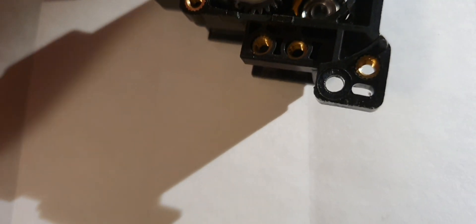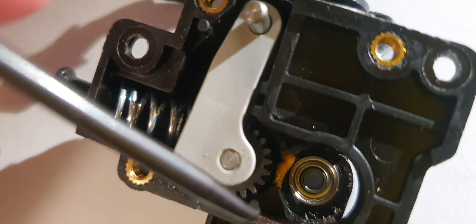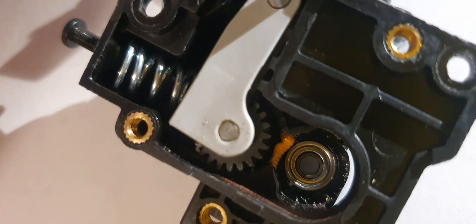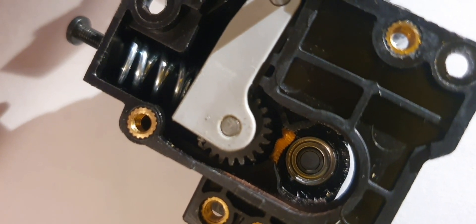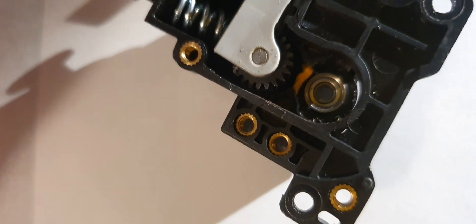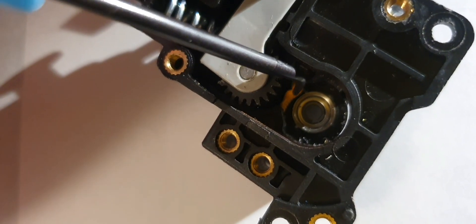Maybe you could change the design here a little bit. Instead of having this piece here come up like an arrowhead, you could maybe have an opening so it comes up like a funnel instead. I think that would be a much better design if possible, to allow filament to pass through if it's just slightly out of alignment, without causing the filament to get squashed, bent, and break. I've had so many clogs lately and it has always been due to this happening inside the extruder.